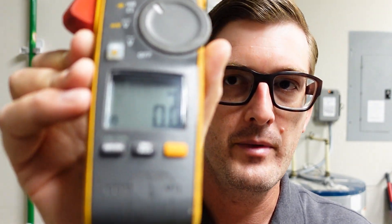So what this is useful for: if we turn on this meter and look at the amp display, it only displays in tenth of an amp increments — there's no hundredths place. So if you need to get a more accurate reading with this meter, or a meter similar, you can make this 10-wrap, and then you simply move the decimal place to the left to get your actual reading.